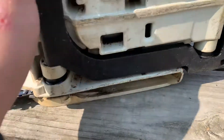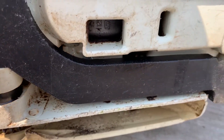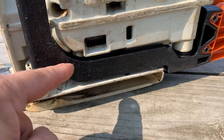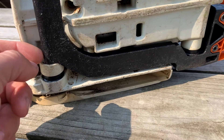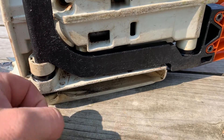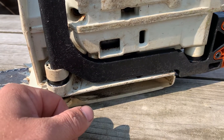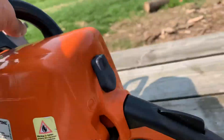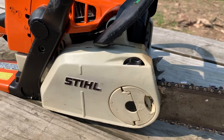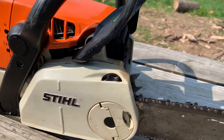One thing I noticed was a clear whitish colored plastic piece with an O-ring. From the factory, that O-ring wasn't on properly — it was kind of smashed against the body. I found an O-ring of roughly the same size, put a little oil around it so it would slide on properly and seal. I started it up and still had nothing — it was still not oiling right, just a little bit. So I forced more compressed air through and primed it — put some oil in through the oil outlet hole, let the air bubbles come through, and let it sit for a bit. Then I started it again and oil started to flow. I revved it a little bit — not full speed — and it was drawing from the tank.